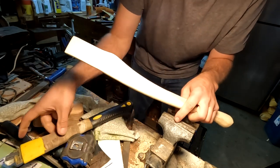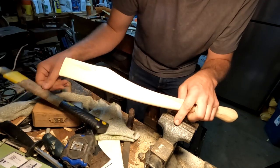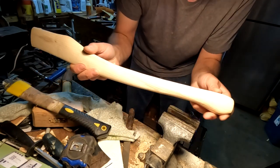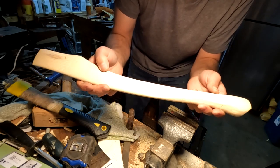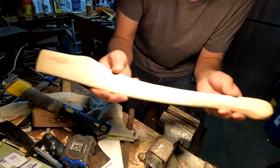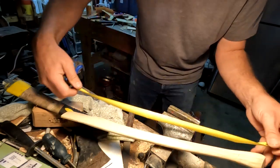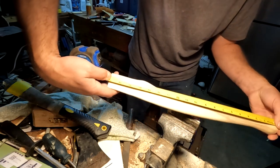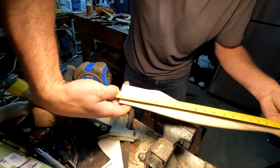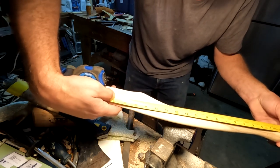Look at carpenters — finished carpenters driving small nails use a short handle, but guys putting up studs driving 3.5 to 4-inch nails through 2x6 use a framing hammer with a longer handle. So the length here — I'd say something like 16 inches of usable grip. It's 19 inches overall, but we won't be using the full top, so we'll probably have an 18-inch usable length. That's a good length for a hatchet, not something short like 12 inches, which is just useless.